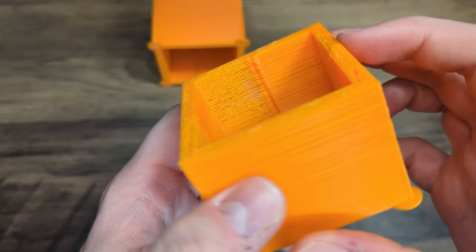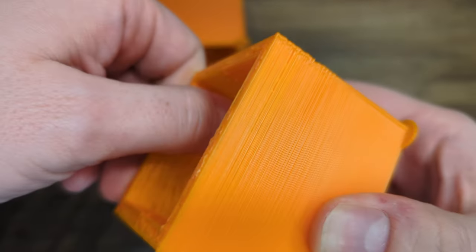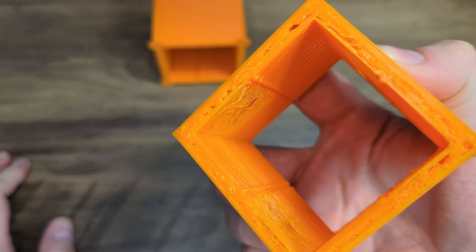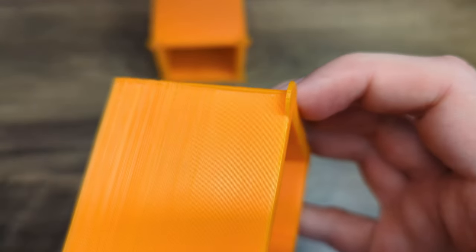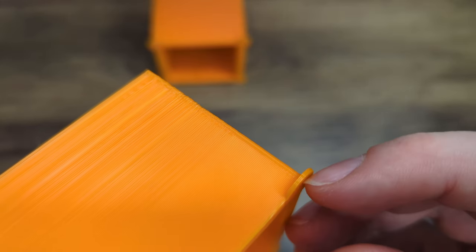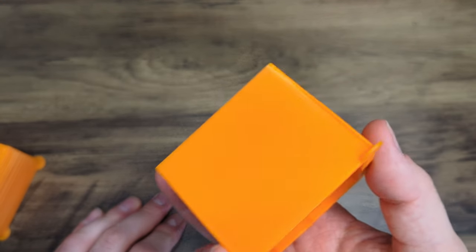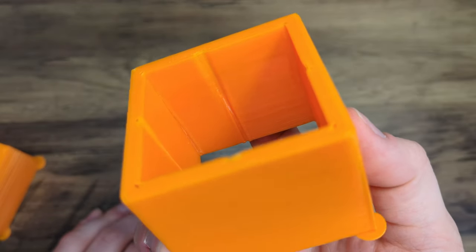The first thing that I check on the tower is whether the extruder was able to keep up with a set Pressure Advance value. I brought you a tower as an example where this was not the case. As you can see, the print quality decreases from about a third of the tower. If this is the case for you, then you must gradually increase the run current from your extruder until you get a clean result. For me, increasing the run current from 0.45 ampere to 0.8 ampere helped me to